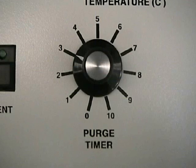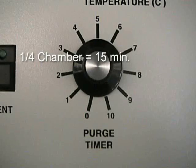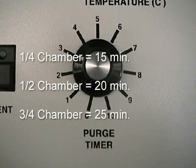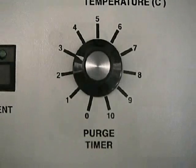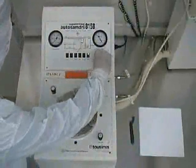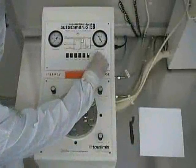The purge time is best determined by the individual user. The general rule of thumb is as follows: for a quarter chamber full of alcohol, use a 15-minute purge time; for a half chamber full, use a 20-minute purge time; for a three-quarters full chamber, use a 25-minute purge time. You should also note that the actual purge time can vary greatly depending on your sample in combination with the fill and purge metering valve adjust positions.